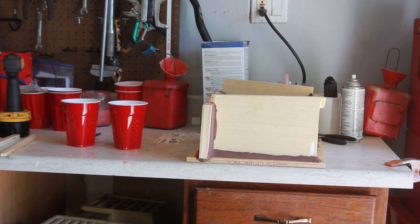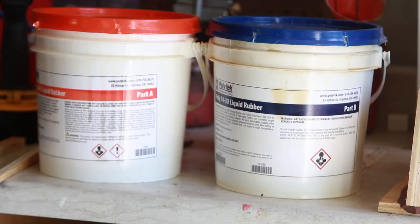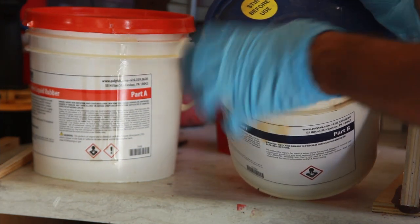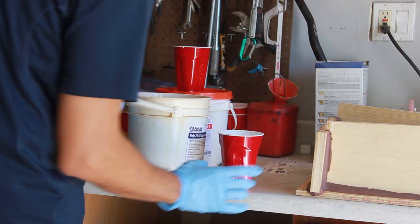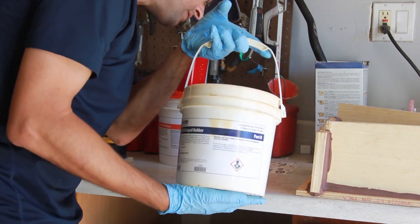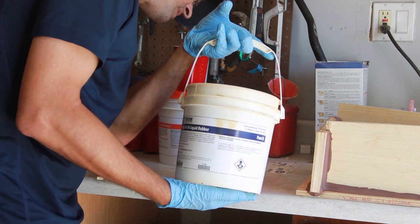Now we are going to be finally putting the polyurethane. What you're going to need is two cups, and we're going to mix equal portions of the rubber. This is the choice I tend to use — it's polyurethane, not silicone. It's about $130 or $140 on Amazon, but then you have to pay for shipping so it ends up a little more expensive. It's got part A and part B, and you want to stir before use — make sure you do this quite a bit. I'm going to pour it to the top of the L marker.